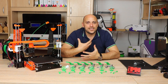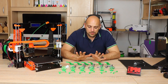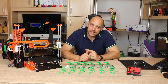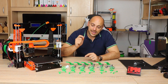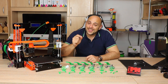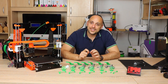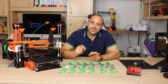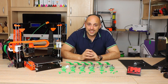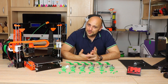Then came the filament and settings. I used 3D Prints green PLA as I feel fairly comfortable with that filament. All models were printed at 195°C on the hotend, 50°C on the heat bed, layer height of 0.2mm, 3mm of retraction at 35mm/s, and a printing speed of 50mm/s with 50% speed reduction for the outer layer. I did not use wipe movement settings and didn't use Z-hop for this test.